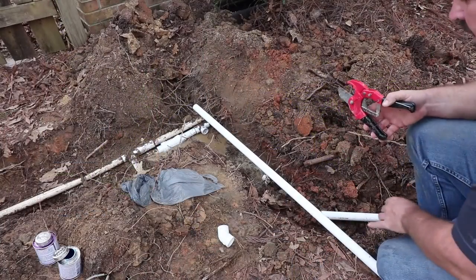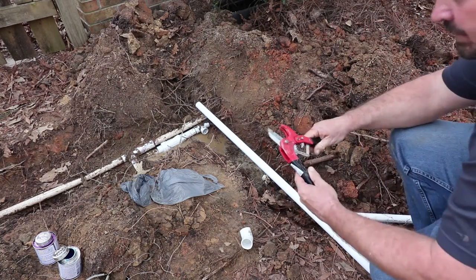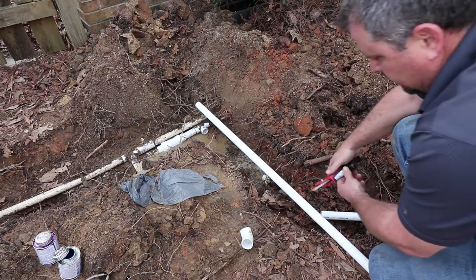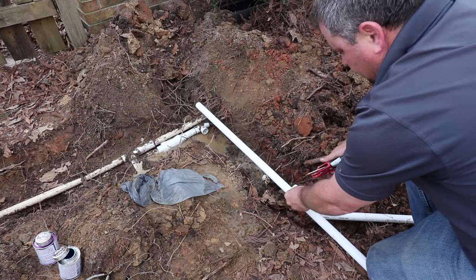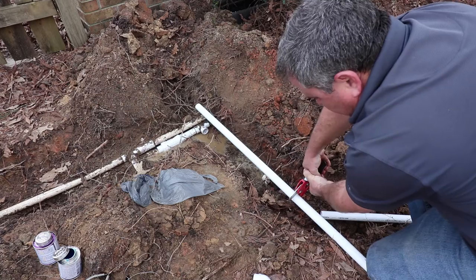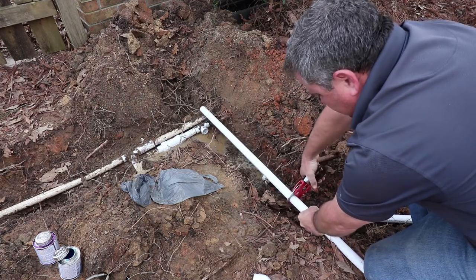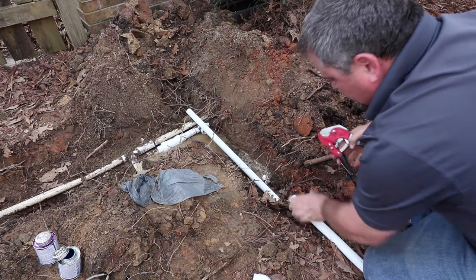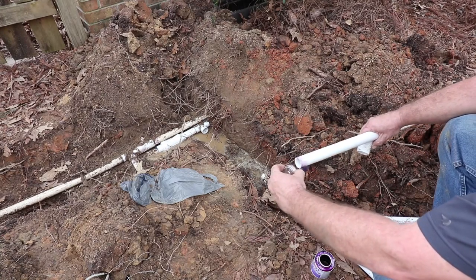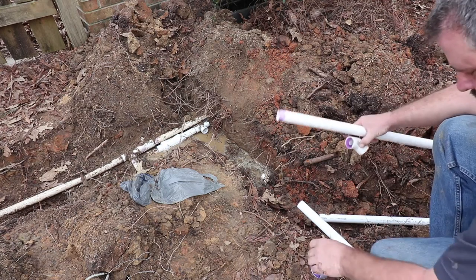I got the expandable coupler in. I'm going to put a 45 right about here. I mark where I cut it and use these PVC cutters — if you have inch or smaller PVC pipe, these make pretty quick work of it. It's just a ratchet. You squeeze down on it, turn it back and forth a little bit to get it started, and then it just quickly ratchets straight through the pipe. I always use the cleaner — this stuff will stain anything, keep that in mind. I'll do both sides of any coupler while I'm doing one.